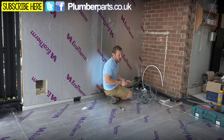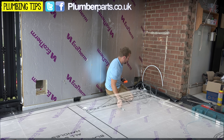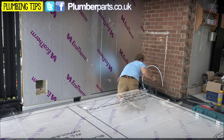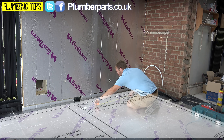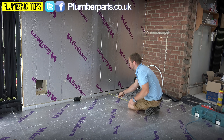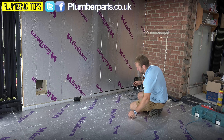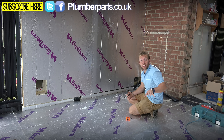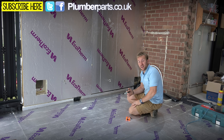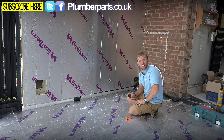In this corner we've got a 500 by 630-deep larder, and then also an American fridge freezer that's slightly bigger - we don't want any underfloor heating there. So the first thing I'm going to do is measure out 630, which is just here on the floor, then measure out 500, which is just there, and then another 1000 for the fridge freezer - which sticks out 700. I now know the area where I don't want any underfloor heating pipes. I'm going to go around the rest of the kitchen, mark out all the areas to avoid, and figure out how my loops will run. But right now I'm going to get my holes drilled back into that toilet so I can get my loops back up there into my manifold.